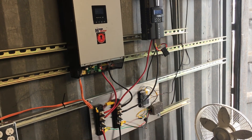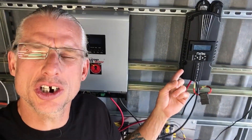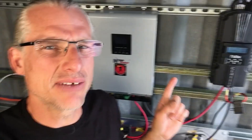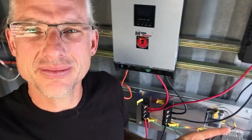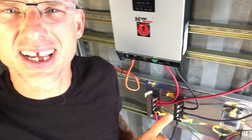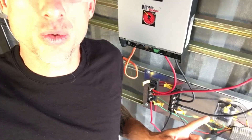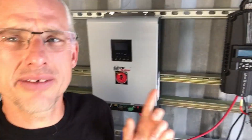I had to put in the Midnight 250 solar charge controller so I could reduce the amount of voltage going into the battery. So now the battery won't ever be overcharged because that goes low enough. There's the DC now. I need a bus bar that doesn't have fuses. I got my 12-volt hooked up - there's the converter, there's 12 volts - everything's running fine.